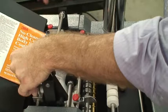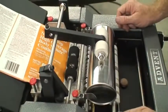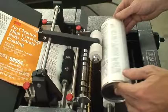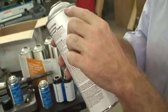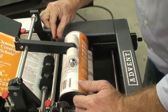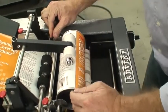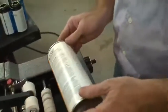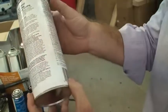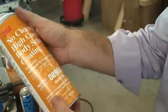I put my guides back in, make sure everything's set, turn it on, and we'll see where it goes. It stalled out so I'll increase my time, insert again, and it goes on. We're a little bit on the high side, so I move the container down slightly — this is a tight label so it's a small adjustment. Using the same container, we insert it and that's absolutely perfect. You can see we have about a sixteenth of an inch on either side, good clearance, perfect overlap — looks absolutely fantastic.